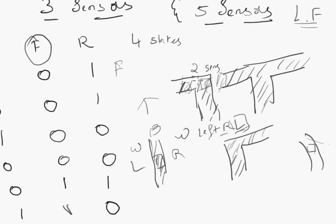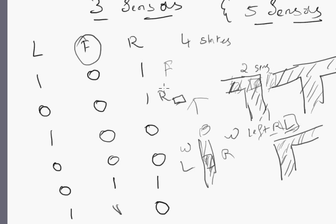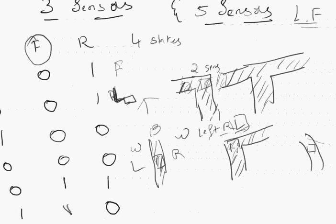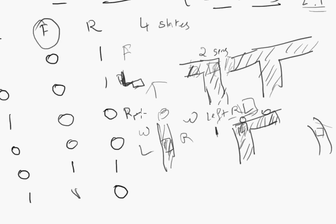For a left rectangular bend, the robot can be configured to turn exactly 90 degrees rather than constantly adjusting. The state zero-zero-one represents a left rectangular bend. Complementarily, for a right rectangular bend, the forward sensor and right sensor are on the black line (zero) and the left sensor is on white: state one-zero-zero. These two are the special cases beyond the two-sensor design. The other cases zero-one-one and one-one-zero are your normal curves - similar to the two-sensor left and right turns.